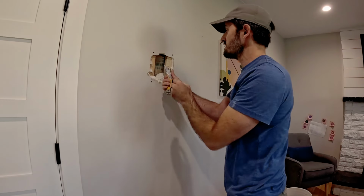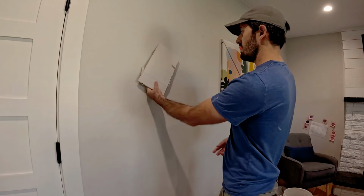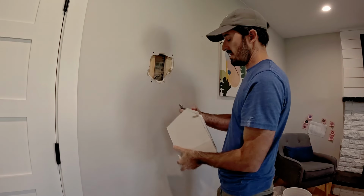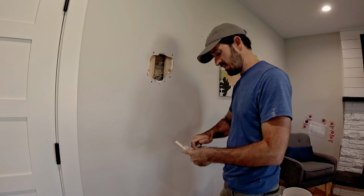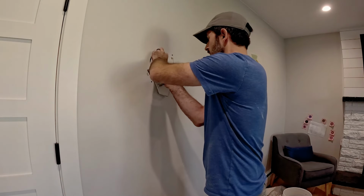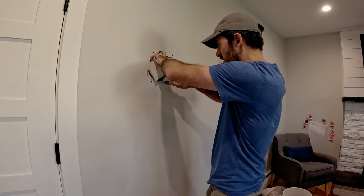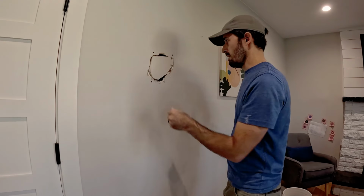Okay, tidy that up, and grab a piece of drywall. Okay, here is a piece, oversized. Again, you don't have to go nuts with making it perfectly sized. I trim it approximately just where it'll fill the area. And if you are using a razor knife, which is what I use, be careful, obviously, very sharp, and you will be missing digits. All right, we're pretty close. So, trim that. Get these cut in to where we've got a moderately accurate piece.